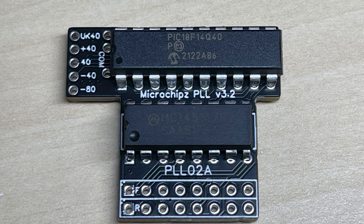The next one is for the experienced modder who wants to add a lot more channels to their radio. You would lock your radio to mid-band by hardwiring it, then use this board to control the rest. This gives you five bands: UK 40 with 1-to-40 readout, high band, mid band, low band, super low band, and of course the alpha channels with plus 10kc where needed.